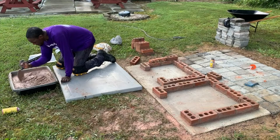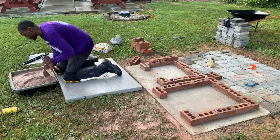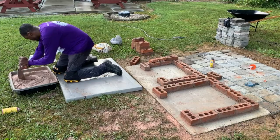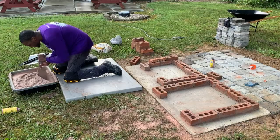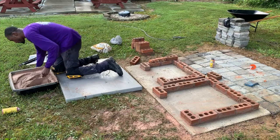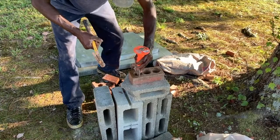The vents on the fire pit side are the intake vents — their purpose is to pull oxygen into the fire pit side and help control the temperature throughout the smoker. I'm also going to have another vent with three holes at the top of the food store side, which will be the outtake vent. The purpose of the outtake vent is to get the bad gases out of the smoker and to help pull oxygen in for the intake vent, creating a draft throughout the smoker. I'll talk more about air circulation in part two of this video.